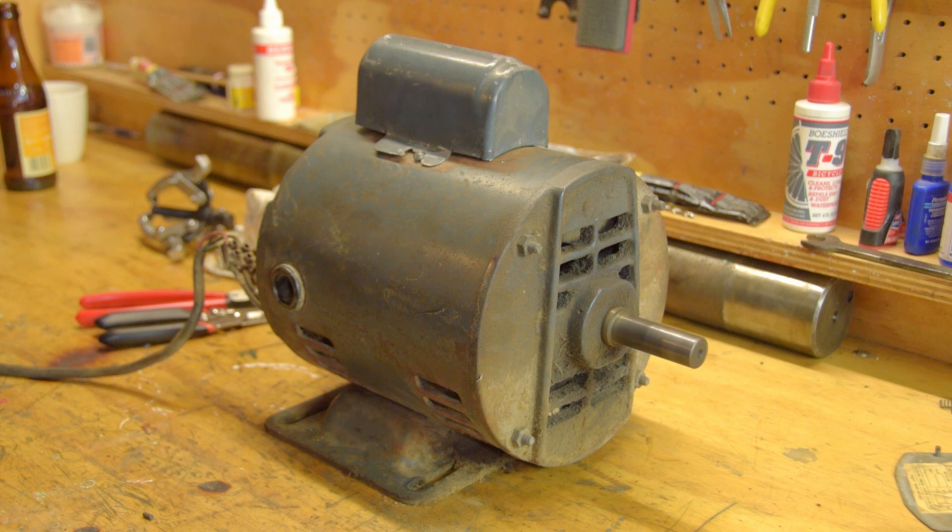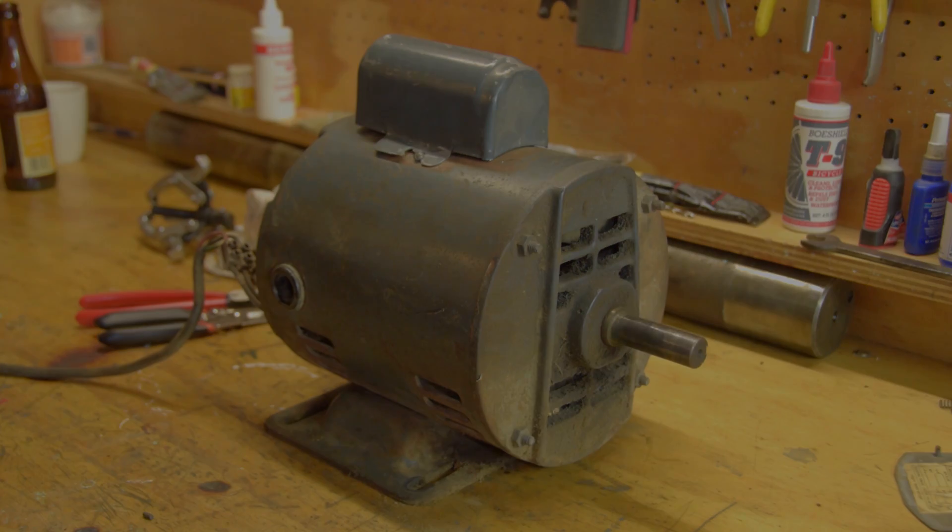Okay, job done. Thanks for watching. No — so the way the guys I purchased it off described the issue was that the motor would struggle to get going and stall. Although there's nothing obviously wrong with it, the most likely fault is a capacitor, which is what gives a single-phase motor that initial kick to get going. There is some inertia to overcome throughout the drill press that it doesn't have to deal with sitting on the bench. Or possibly there was a short somewhere else that unshorted itself on the 200 kilometer trailer ride home.